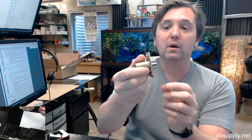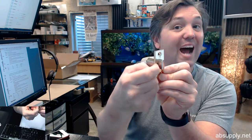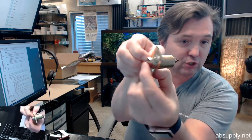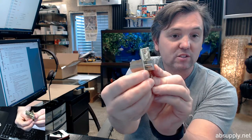What's the difference? In the proper installation of a deadlocking latch bolt, when the latch bolt hits the lip of the strike and then goes into the hole, proper installation will force the deadlocking trigger to stay retracted and not go into the hole. Well, when that's held in, you can no longer push the latch. When it's not retracted, you can push in the latch. That works to make the lock jimmy-proof. That's the purpose of that deadlocking tab, and you'll certainly want to order it correctly.